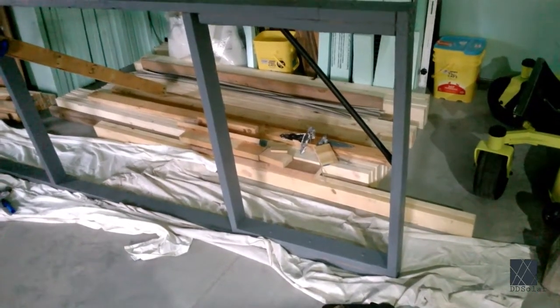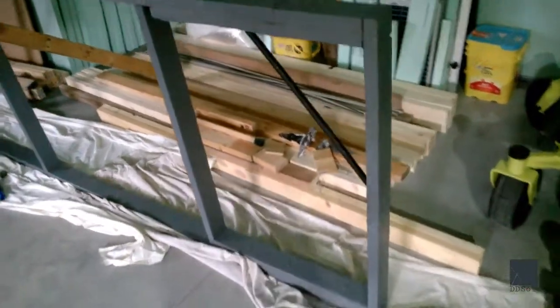This is the second solar panel frame I've used these pieces on. I still have a few left, and I'm very happy because I will be using those as well. I used a 3-inch structural screw and a 1.5-inch fender washer, stainless steel. And this will really give good diagonal bracing to this frame.